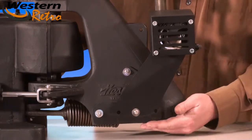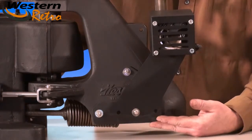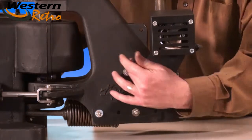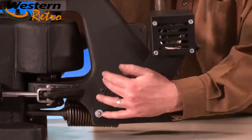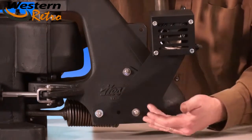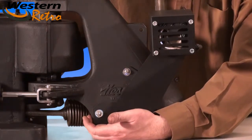The first step is to mount the bracket of the Wobble Kit up against the X3 cast, which is the front nose — it looks like the shape of a nose, and it's called your X3A. Make sure that the bracket is flush with the bottom edge of the X3 and right up against the corner here.